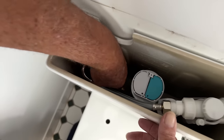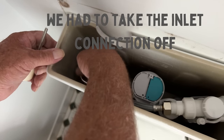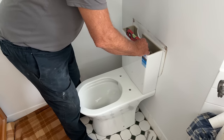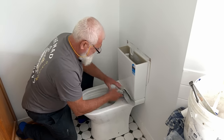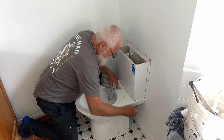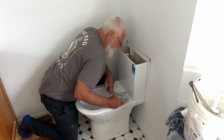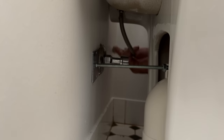We've come across a problem: the hands are too big to fit inside the toilet to do up the cistern nuts that hold it in place, so we have to come up with a plan B — which is to temporarily remove that inlet connection. Checking that the cistern is sitting nice and level — it's flush. So tip a bucket of water into the cistern, check around the bolts, and check the flush. Nothing coming out of the sides or the back, because it's got the rubber seal and if it's going to leak it will come out of those points. So that's all good. Now we can connect the water.